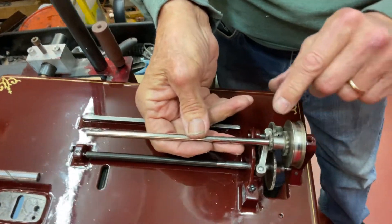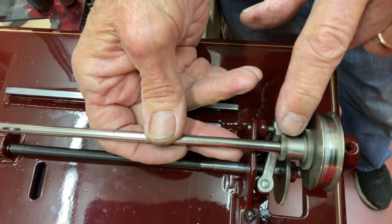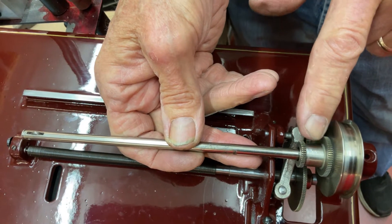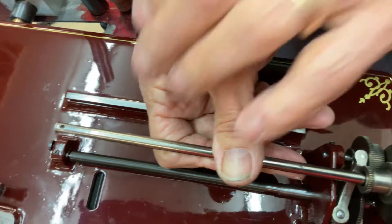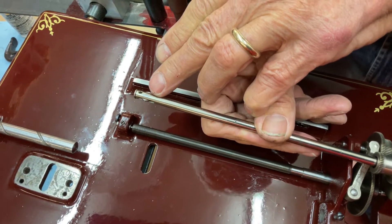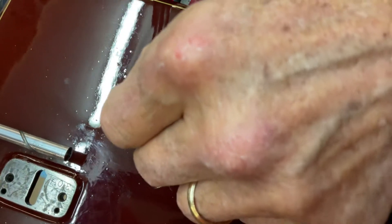So what I had to do was, I took a tapered pin and I fit it to this, and then I had to cut it down. And then I filed it off right in here. You can see where I trimmed that, and I trimmed this end too. This is the big end, and you can barely see in there — there's the small end. And that's how they hold these in place.